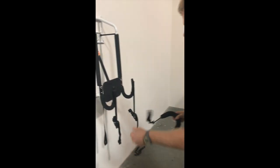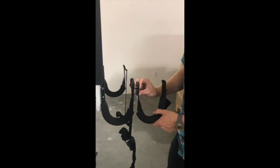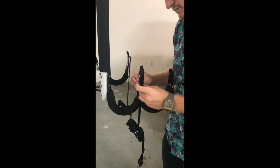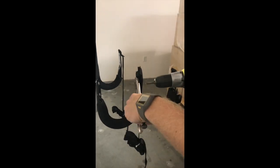There are two holes located on the front of the Single Surf Kit arms. Adhere the Double Surf Kit arm to the Single Surf Kit arm using the necessary bolt, nut, and washer. Tighten the hardware as necessary using a drill and wrench.